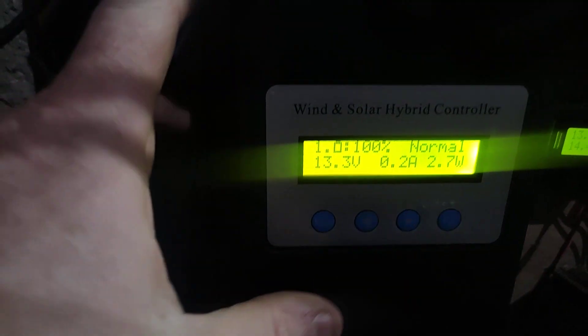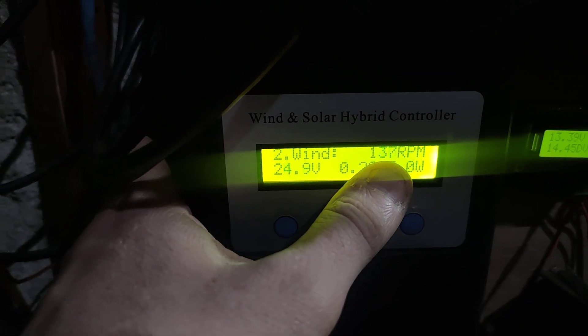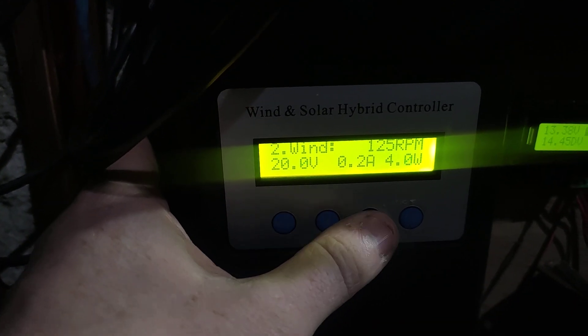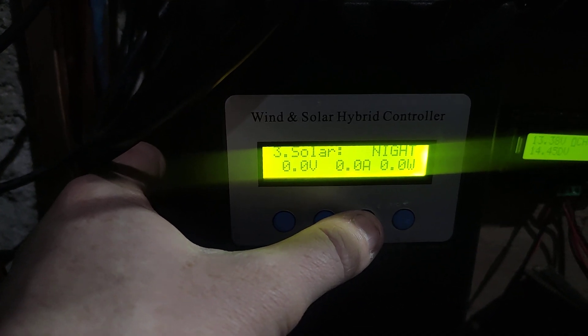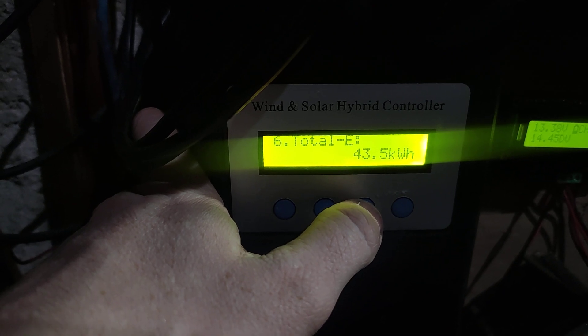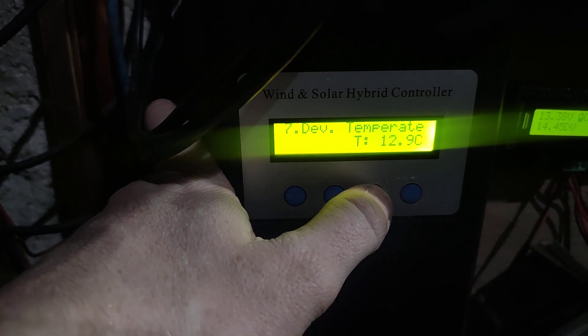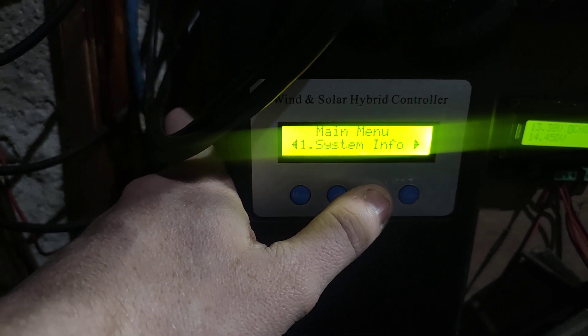That's the advantage — you get less voltage drop and therefore less power loss, so these are more efficient than just using a rectifier like this one. There's a rectifier built into the controller. The display also shows your battery voltage, wind voltage, RPM (though I'm not sure how accurate it is), and there's a solar input as well, though I don't use it — I think it's 100 or 200 watts. It also shows total kilowatt-hours generated and device temperature, and mine shows no errors.